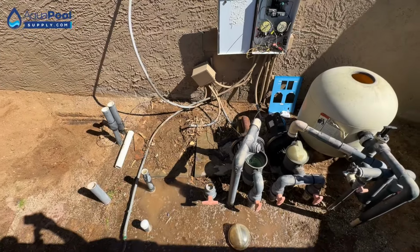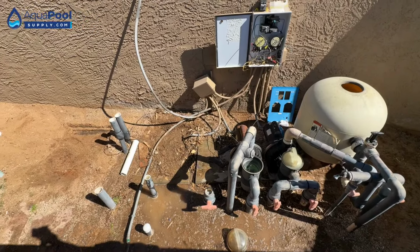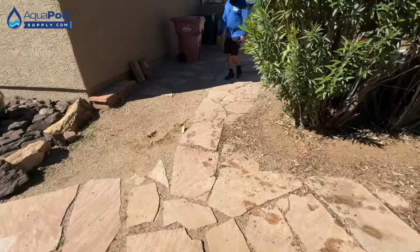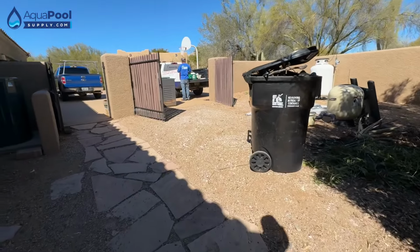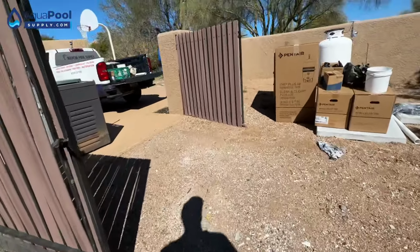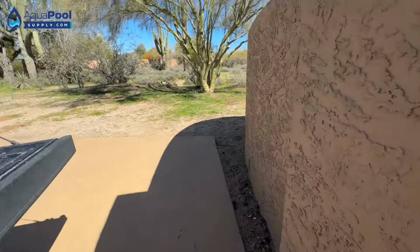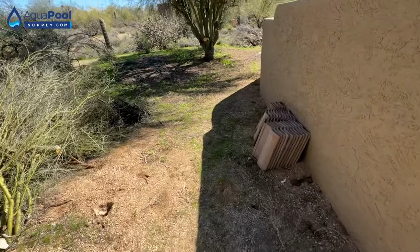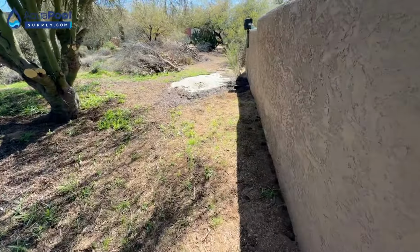We got the heater, first filter out, spa pumps out. Now we're going down the line, jet pump, filter pump, other filter. Then we're gonna level it all out, drop our pads down, plan our equipment, start install. Probably the hard part is just clearing it all out, especially when it's a sand filter, because you just got all that sand. There's no skill level to the sand, just the labor. Exactly.